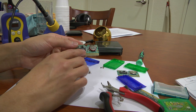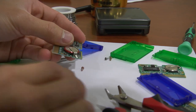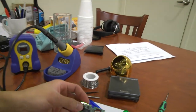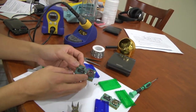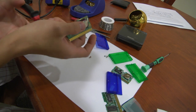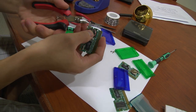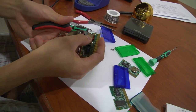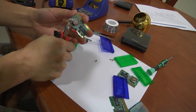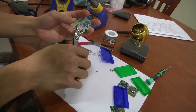We don't want to end up frying it. We just need to desolder this tab and this tab. Alternatively, I could just cut these tabs and then desolder them that way. On my other approach, I actually ended up cutting the tabs to make it a little bit easier to remove them. I just have to be careful not to destroy the pin on the IC. All my childhood memories would go away if I end up destroying the IC on the bottom.